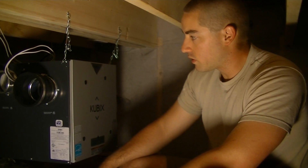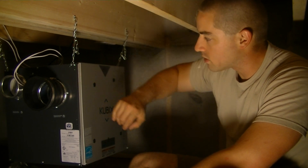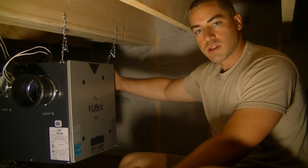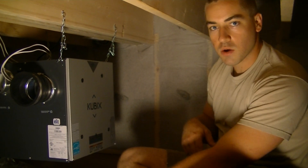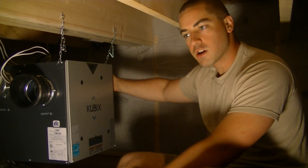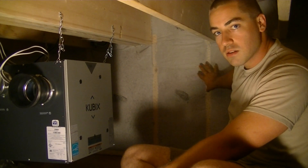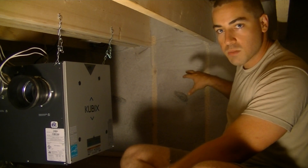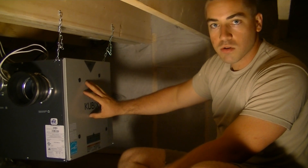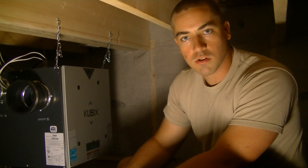So in the whole house, the most leaky part is going to be the HRV itself where the metal connects to metal. Out the backside are my two ports that will lead to the outside of the house — I showed those in another video. I'm going to have the supply of fresh air and the exhaust of stale air out this side, facing the wall so those runs are as short as possible, because I'll have to insulate those runs. Once they're past the core — the heat exchanger — they've become tempered, so I don't have to insulate any of the PVC pipes inside the crawl space.